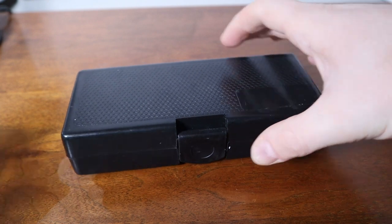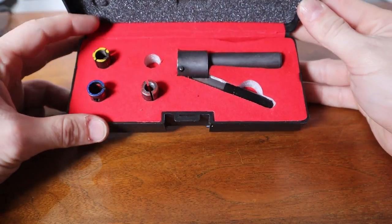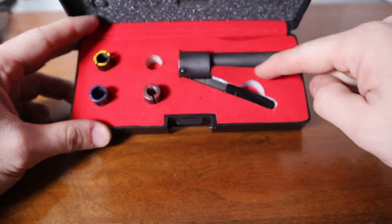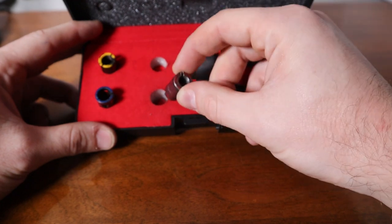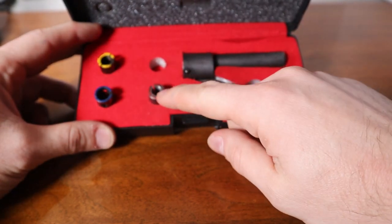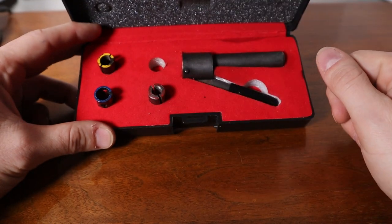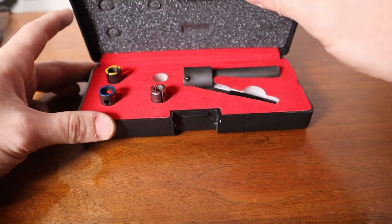the main things I'm going to be using for this repair, and probably most of these you've seen. So I'm going to be using, of course, as a Vacumatic, my Vacumatic wrench set, so the little clamp wrench, and the three attachments. These Parker 51s, I think, have always used the smaller of the die sets, but whatever lets you thread, grip, and be able to untwist the plunger set. Lefty-loosey, righty-tighty on those.